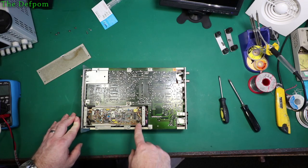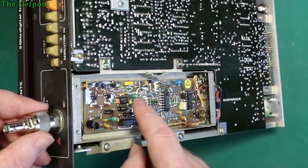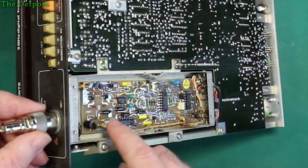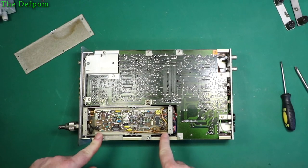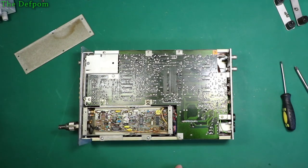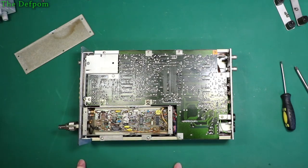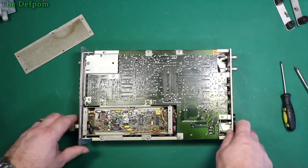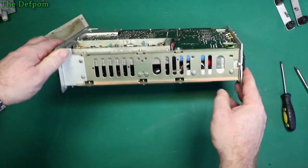But a tantalum capacitor, they're actually pretty reliable capacitors, but this one here is also discoloured. There's another one. Those two there are both discoloured as well. So there's a few tantalums on the way out, it looks like. As I was saying, tantalums are really reliable capacitors unless the power supply feeding them is really noisy. They don't like big spikes or high ripple. So the fact I've got three capacitors on this one board which have all failed, that's not a good sign. That means the main power supply is probably failing, which is in there, which I've got to try and get out.